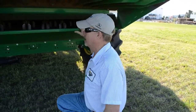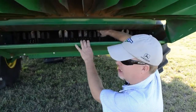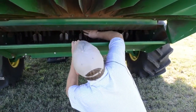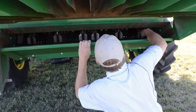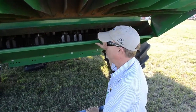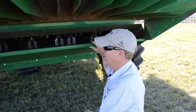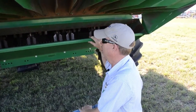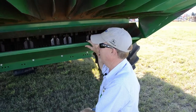We recommend checking our rotary knives — those knives attached to the chopper rotor — daily. On the S-Series, you can raise the chopper, put the chopper gear case into neutral, roll the drum around, and flip those hammers. I recommend on any S-Series combine that we take the time to check these knives daily. The problem is when we lose even one out of 44 knives, it sends the chopper into a vibration situation. It's very hard to feel that vibration in the operator seat on S-Series combines, so make sure they're all present, accounted for, in good shape, and sharp. Proper residue sizing as well as horsepower draw are both affected.